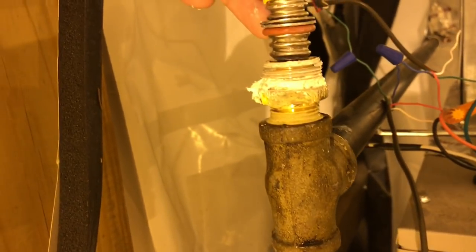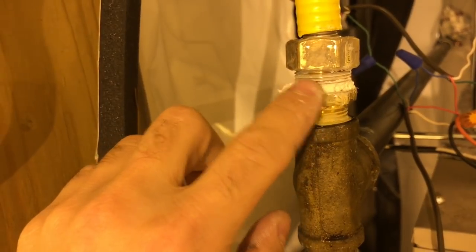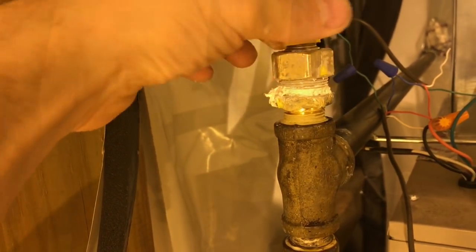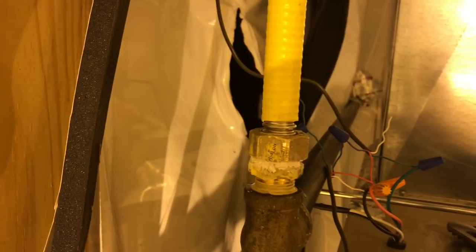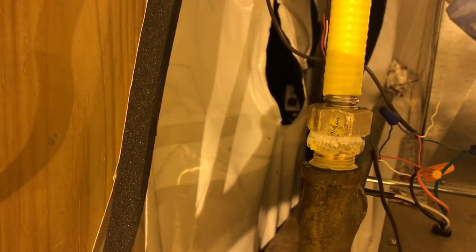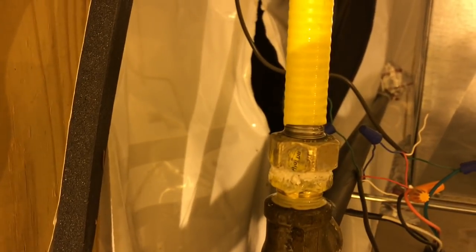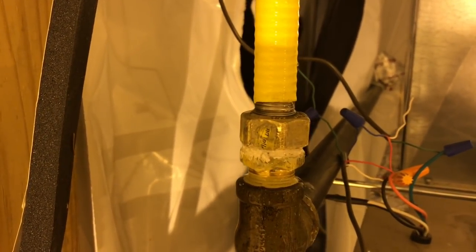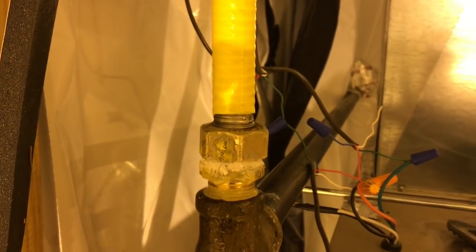Put this into the hole and put some more thread sealant on here, then screw it together. A good trick: get some soapy water — I had bubbles right here earlier — and spill the soapy water on there to see if your gas line is leaking. Guess what? No bubbles. Thanks for watching, hit the thumbs up button, use this tip to see if your job is well done, and have a good day.